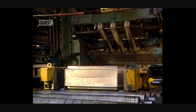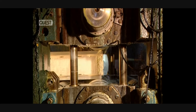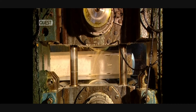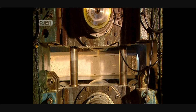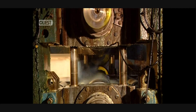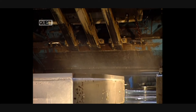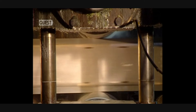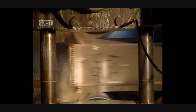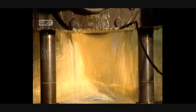The next process is the most stressful: the thinning of the ingot begins. The aluminium block is crushed by the hot mill rollers, which operate at temperatures between 455 and 540 degrees centigrade. The pressure on the ingot must be verified first — if too great, it could split the block and the process would have to start again. The heat is so intense that the ingot risks sticking to the mill's roller, so a lubricant that's 95% water and 5% oil is used to prevent this.